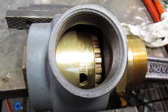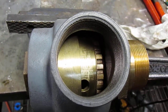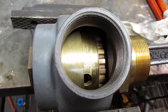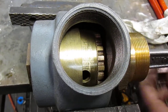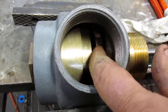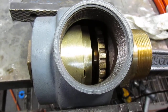To answer your question: it's a great device to relieve negative pressure off your blower, but to me it is a very pricey part. Because for almost 5% of the cost of one of these, you can simply build the one that we use in our truck mounts and it does the same job. Just to sum it up, it's a spring-loaded valve. As the air gets sucked out of that hole, it forces this chamber to open up — you'll notice the end of my tool pushing it — allowing air to go inside and reach the blower.